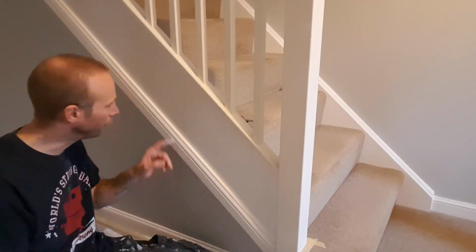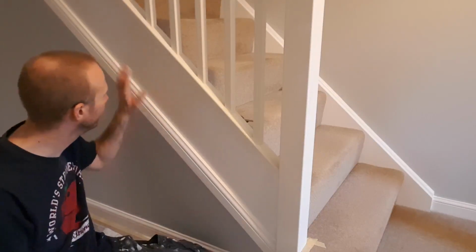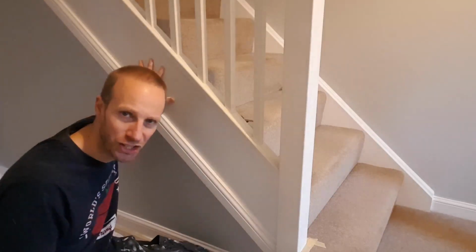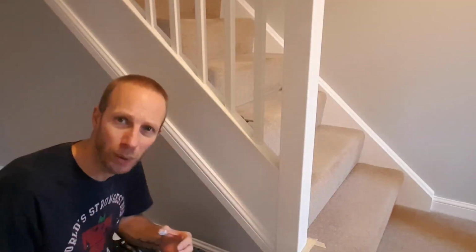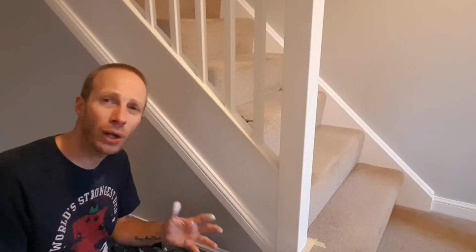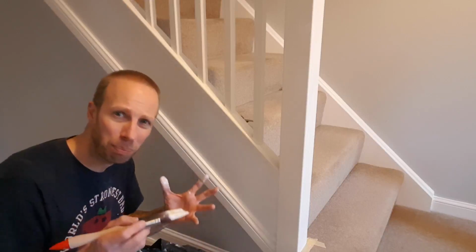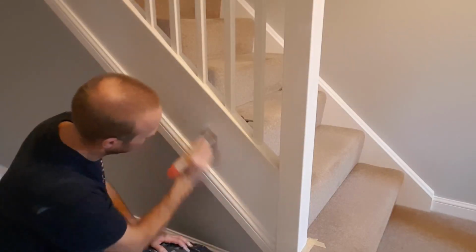There, you can definitely see this looks really white, really nice and clean, where this still looks kind of dirty and yellow. So it's the oil in the oil-based paints which in time turns the paint yellow. So if you're using a water-based paint, you're pretty much guaranteed that it is going to stay white.